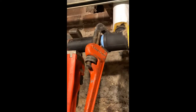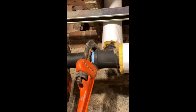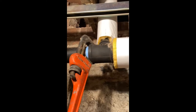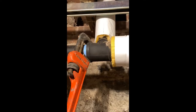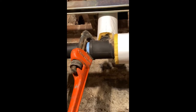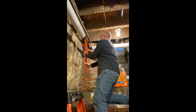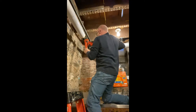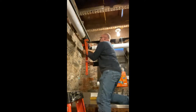The plumbers basically connected two radiators to one pipe, so we're going to fix that. Each radiator should have its own individual pipe, unless you're talking skyscrapers, but there are specific methods you have to follow with a single pipe riser going into radiators. We're going to keep it simple - just put another T there, drill a hole right here above the floor, and get that connected. Two pipe risers on this thing: one is a 36-inch, the other is about 18-inch. It does the job.